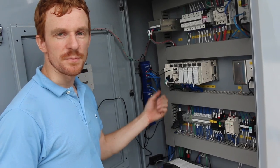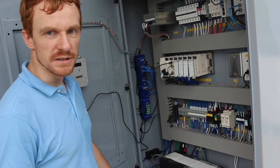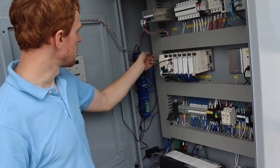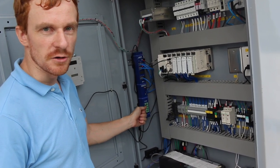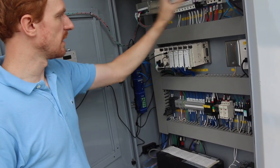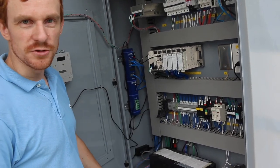Here at the telemetry panel is where all the communications equipment is. We've installed our SPX Plus here, DIN rail mounted. We've got the ultrasonic fuel level sensor, temperature and humidity sensor all connected up here. Dry contact running back to the generator to check its on or off status. Our DC volt sensor is also plugged in here, connected up to the ethernet network, and we've grounded the system correctly to the main grounding of the control panel.